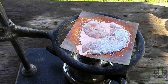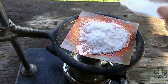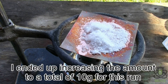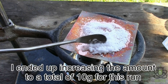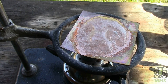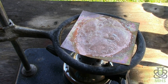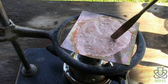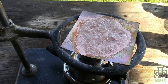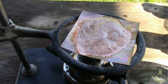As this goes I'm just going to add more boric acid as we make room for it. I chose 6.2 grams because that's about what fits on this plate. You can see it turns into a glassy mass that's really sticky, so it's kind of difficult to stir — occasionally I'll poke at it to pop bubbles. It looks like it melts but it really doesn't — it's just losing water, which evaporates as the steam you see. We want to keep doing this until it basically stops bubbling and steaming.